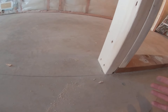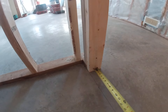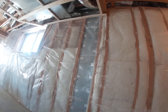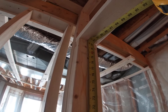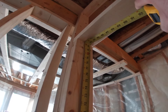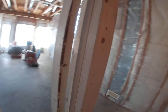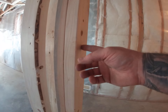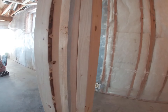You will have five inches on the width. Then you fix your studs to the sides of the frames and the floor plates, and you cut your studs 82 and a half inches — that's where your header goes, right there. Make sure that the hinge side of the frame is perfectly plumb, and the job is done.